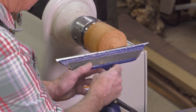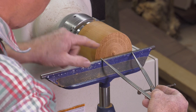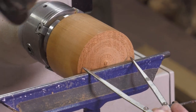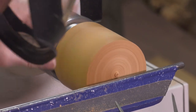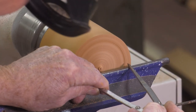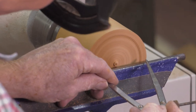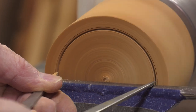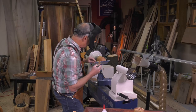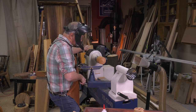I'll get set up so we can hollow this. There's a technique where we use dividers — see each point on the diameter, it just barely is inside touching that cork-like lid that will angle into the hole we're going to create. But how do you match the hole to the lid? You swing the tool rest around so it's adjusted on center line, lock it in, and with only this point touching, you keep this point back — it's only there to match up diameters. You start inside with this point swinging down, hold that point down, and keep walking it out until the point on this side matches. When you have that at the right spot, you stop. That's the diameter we need to create. Let that come to a stop — don't be moving that tool rest until it's safely stopped.